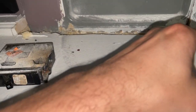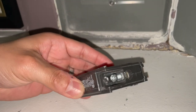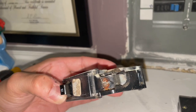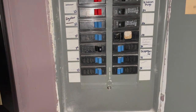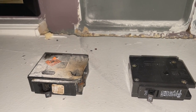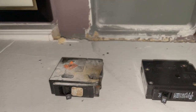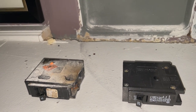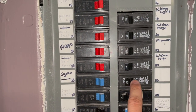This is what it looks like normally — this is a brand new 15 amp circuit breaker. It's obviously old, but you have to be careful: you want to turn off the main power first. The real problem was the actual wire going to the circuit. It was so frayed — the plastic insulation surrounding it had burned off, and the actual wire burned off too. So I had to pull it down further, clean it up, and connect it to the new circuit.